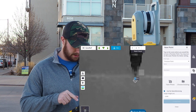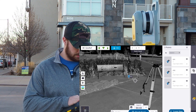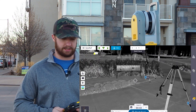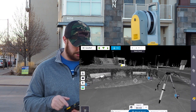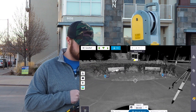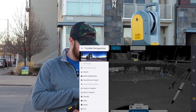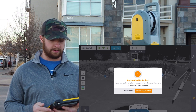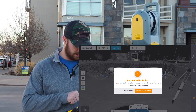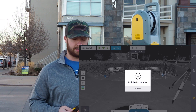So I've got three ground control points in our X7 scan module and four ground control points in capture. Next, what I need to do is actually do a georeference. I'm going to tap the hamburger menu in the top left and you'll see the button georeference project — I'll tap on that. It's going to ask me to refine my registration first, so I'm going to go ahead and refine my registration — this will only take a minute or two.